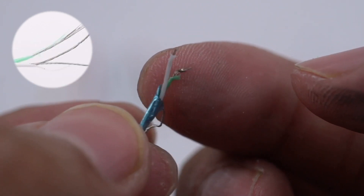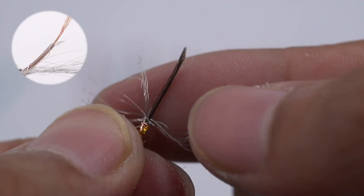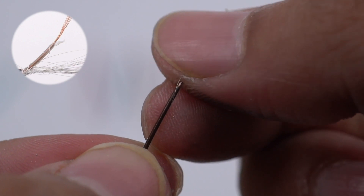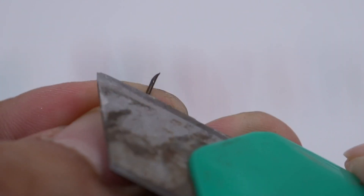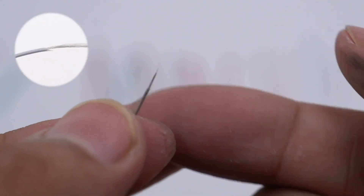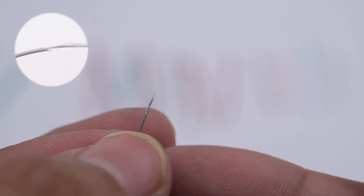The tinned copper wires are inside. The outer layer of the thick core is copper foil and a shielding layer. It adopts copper wire to transfer data and is covered with an insulating tube to form the coaxial cable, used for high-frequency and high-speed differential signal transmission. Other thick cores also adopt a similar design. As for the thinner cores, only tinned copper wires are inside, and other thin cores also adopt a similar design.